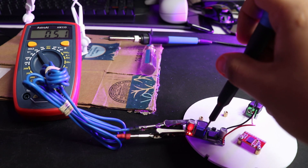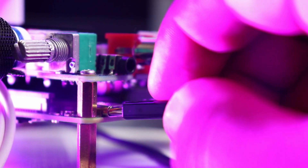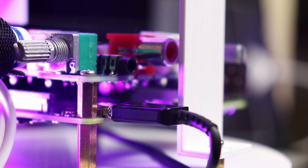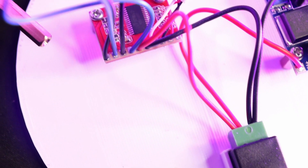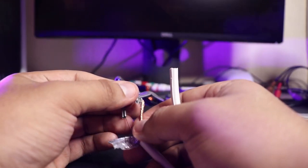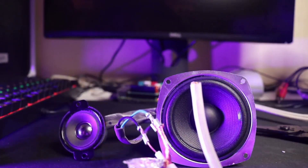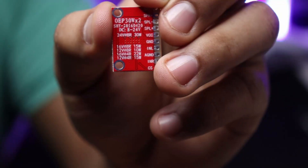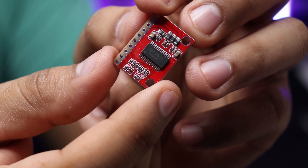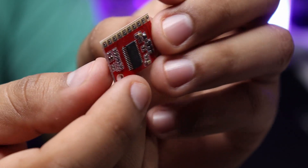Then using the wire holes, we can route the output from the Raspberry Pi using a USB-C cable that I wired directly to the output of the buck converter. And then the second part of the split is this digital audio amplifier. If you've seen part two of this series, you know that the amplifier of the sound card was not powerful enough to get a decent audio level from the Raspberry Pi. So this little board here allows us to get a much louder sound level. The wiring comes from the audio card to the amplifier, and then back up to the speakers.